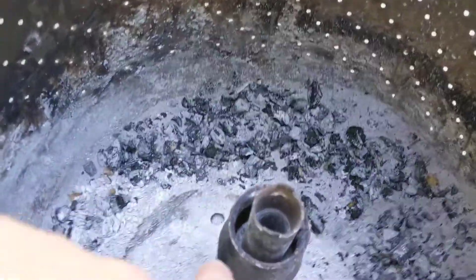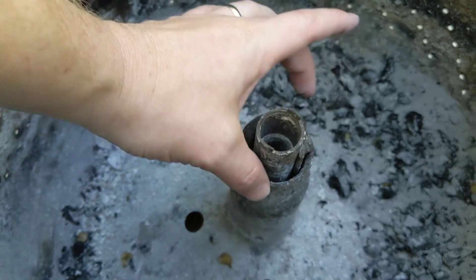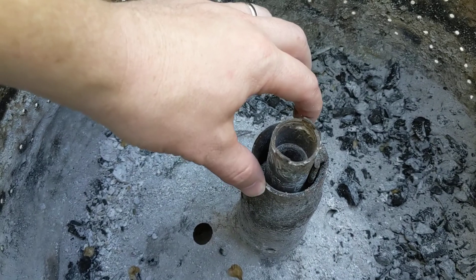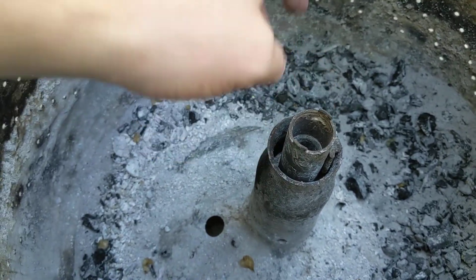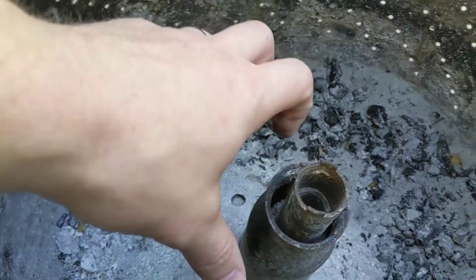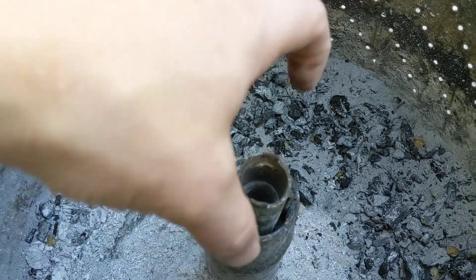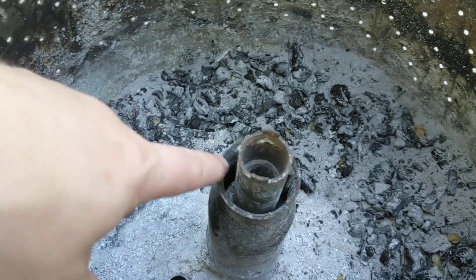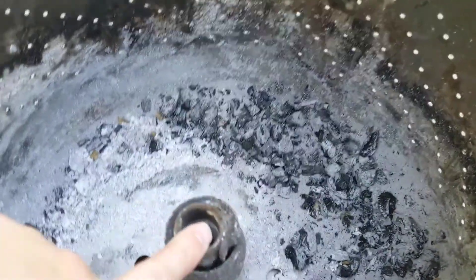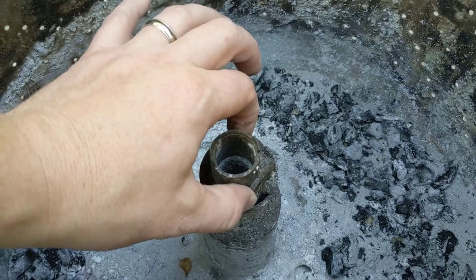You can see here I had to actually weld this, because inside was a nut that holds the actual tub on the base, and I assume it would spin around that. During the first fire, we noticed a bunch of molten aluminum had flowed out of the center — the fire got hot enough that a series of nuts and probably some press washers in there had melted and flowed out. So the whole thing was loose on the center, and I just quickly cut a piece of angle iron and put it in to stabilize it and then welded it.